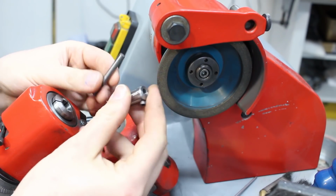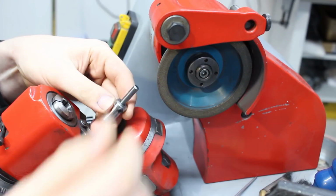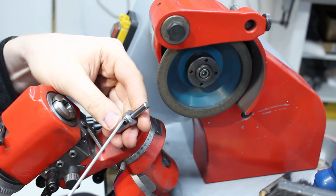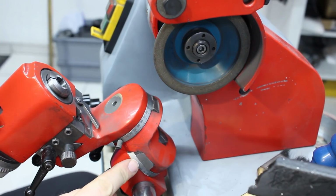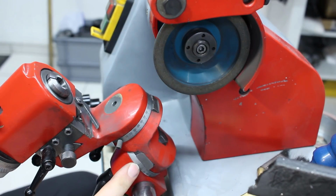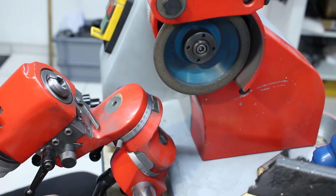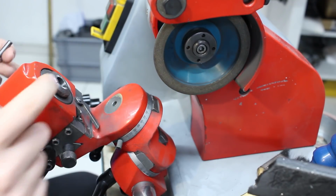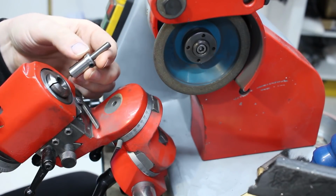So we take our bushing that we made earlier, get our blank in here, and we lock the tool down with the screw, just so it doesn't move. This lower joint here is at 90 degrees. That's a lie. It's at 0 degrees, and this upper here is at 0 degrees too. The indexing head here is also at an even number. In my case, I will turn it to 90, and I have a 12mm collet in here that matches my eccentric bushing.